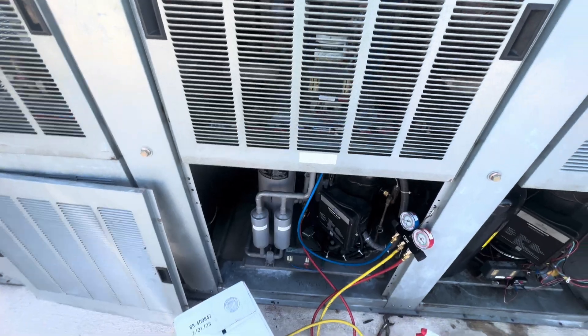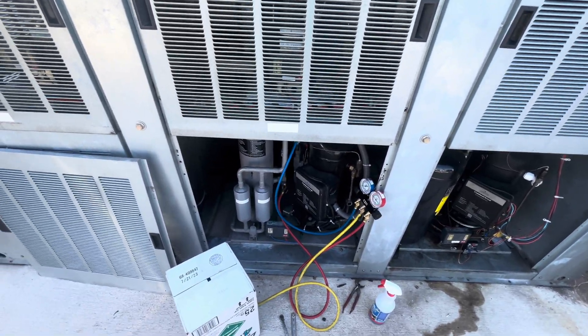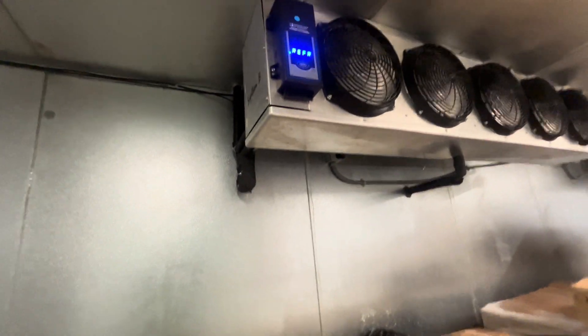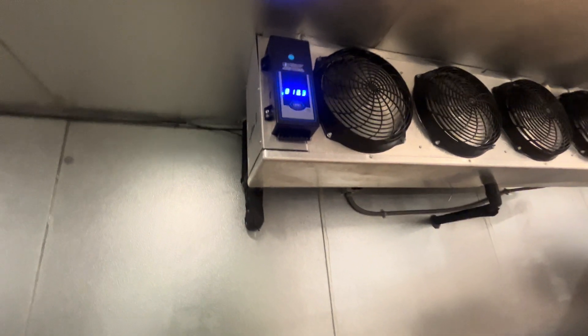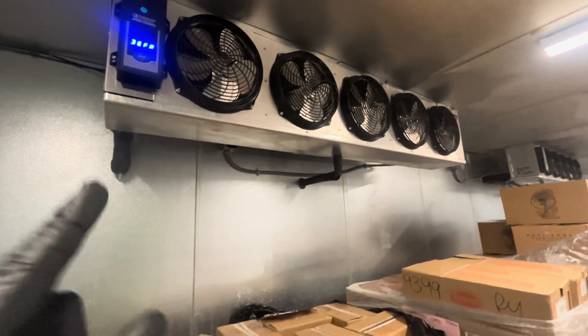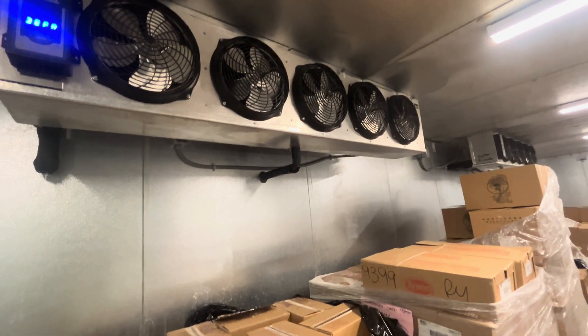And then I'm going to throw it into another defrost and just let it make sure it defrosts right. That's negative 1.9 — I'm going to remove that sensor. Let me just check my superheat. 10, 9.9, 10 degrees. We are on the money. I was right about those fans. Now that that coil does not have all that ice on it, all of those fans are running.